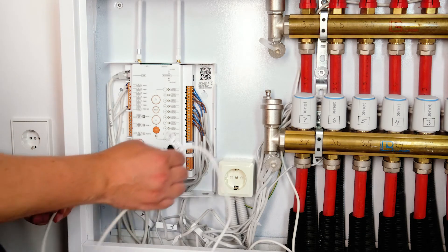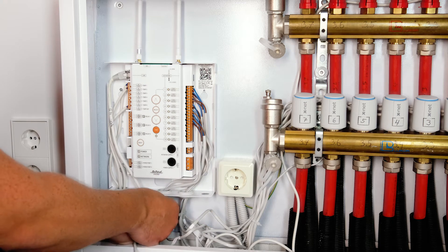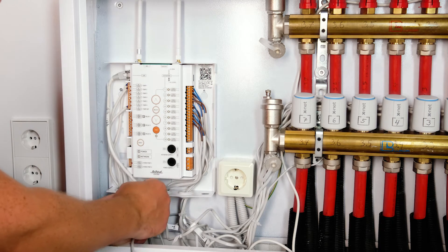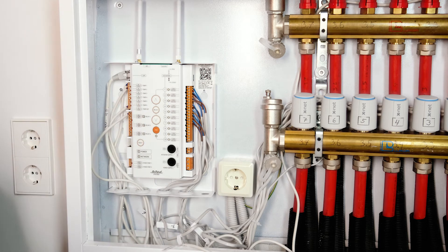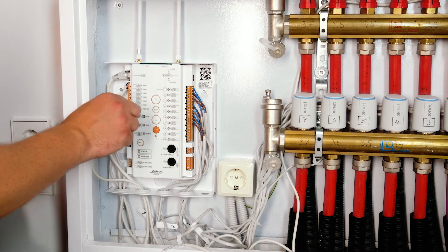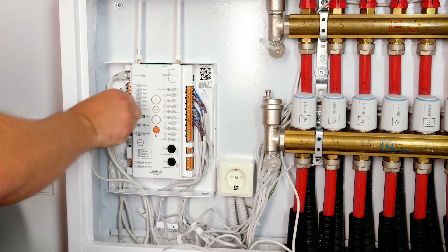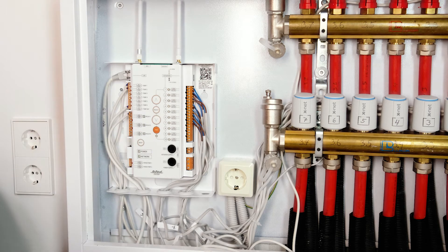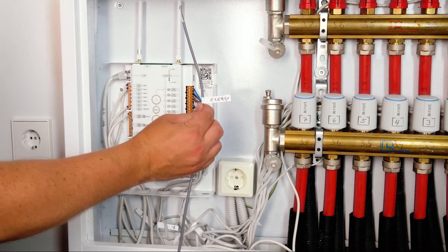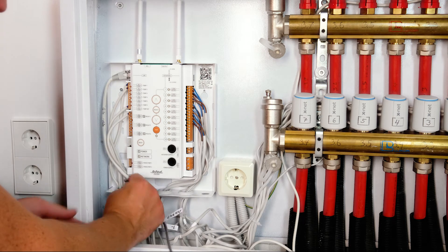To minimise energy usage, up to three electrical devices can be controlled by the control unit through built-in relays. Connect the cables by following the wiring diagram as set out in the user manual. For a complete energy usage overview, up to three MBUS energy meters can be connected to the SmartHeat system.